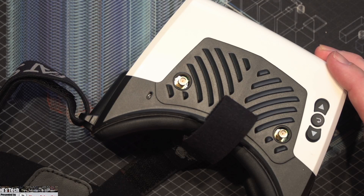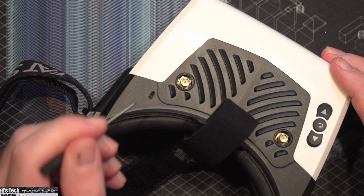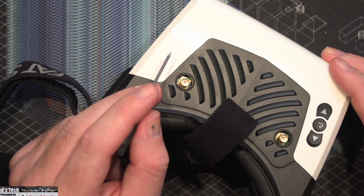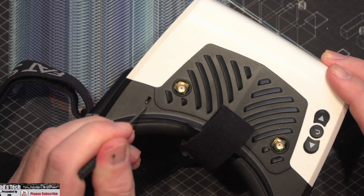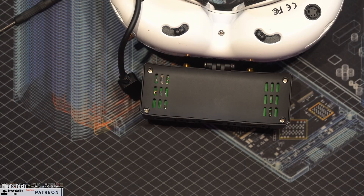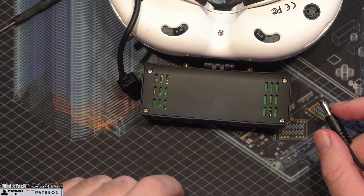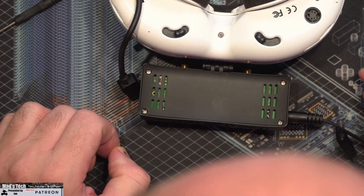If you're using the Scout HDs from Fatshark, this little switch is located in this little slot here. You may need a set of tweezers to move it. Put the switch into the forward position for recovery — the normal position is at the back. So simply slide it forward into the recovery point. Once done and the switch is in the correct position — forward on the Scout HDs or down on the goggles module — you can then power it up and let the update process begin.